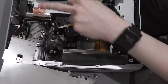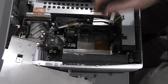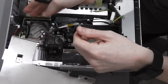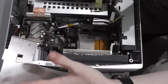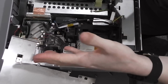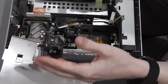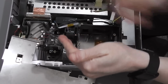And this chip here, this is what does all the work. This is a digital micro mirror device, and not something I knew the name of before, but it's got a lot of mirrors inside which can reflect the light out or dump it away. And so the larger projectors have 3 of these in, each one dealing with one of the 3 primary colours. And then that light gets recombined and sent out as a single image.